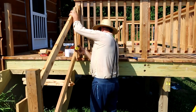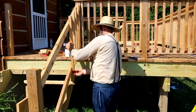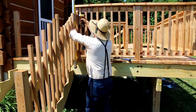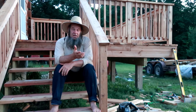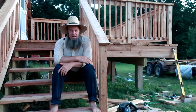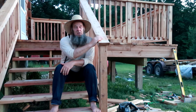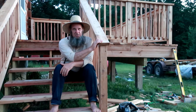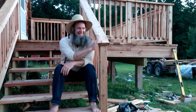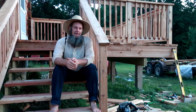After that I started working on the spindles. Somebody asked in our last video when I was showing some of the deck build — they were asking about the spindles and noticed that the angle cut was down. He said normally people put that on the up so the water drains off. I had to reply and let him know that we were putting caps on top of all of our rails, which just makes it look nicer — gives it that bossy kind of look. We have the rails on top with the caps and everything just came together real nice.